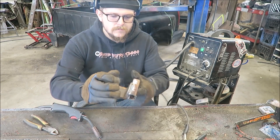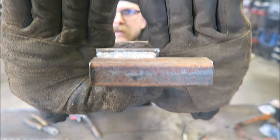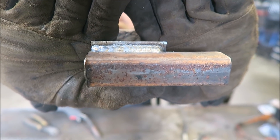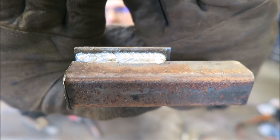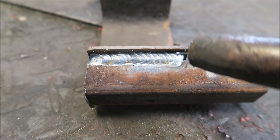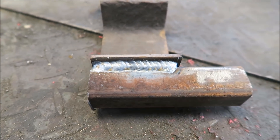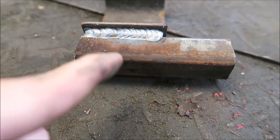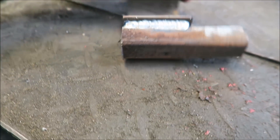That's doing the J technique — I start here, let it burn in for a second, go up and then kind of back over. It's worked really well for me. You can see where I got a little ahead of myself there, but for the most part I call that good. It'll hold up longer than most of the stuff I weld it to. So that's my take on welding: circles for the vertical, and J's to go sideways.